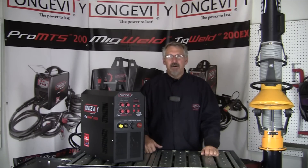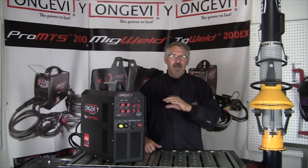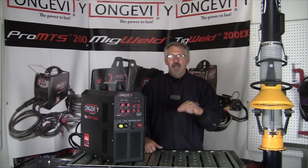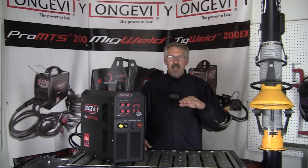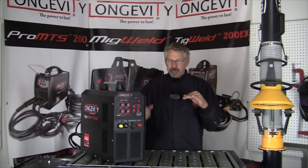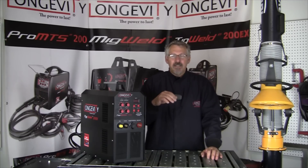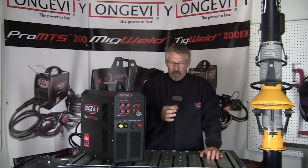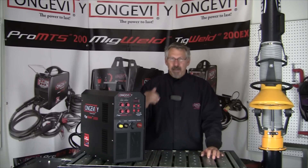Over time they've learned that you don't need as much EP cleaning of the weld, so they reduced that to around 30%. With inverters, you can reduce the EP side down further — and the EP side takes more power through the electrode — so you can reduce it to 15 to 20%. Therefore you can use a smaller electrode, a smaller tungsten, because you needed a big ball on the end and a heavy electrode to handle the large EP side of the power coming in. But now that EP side is reduced.